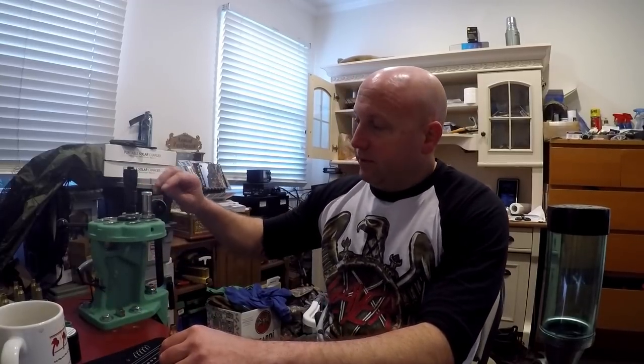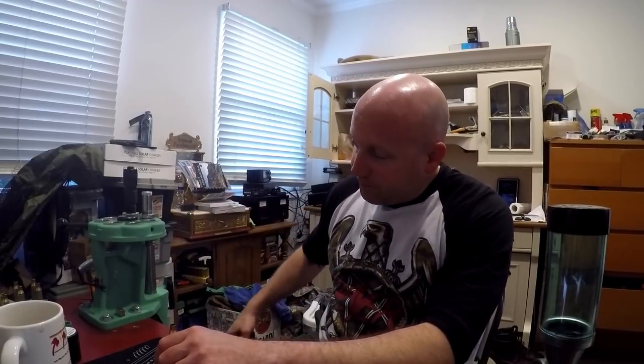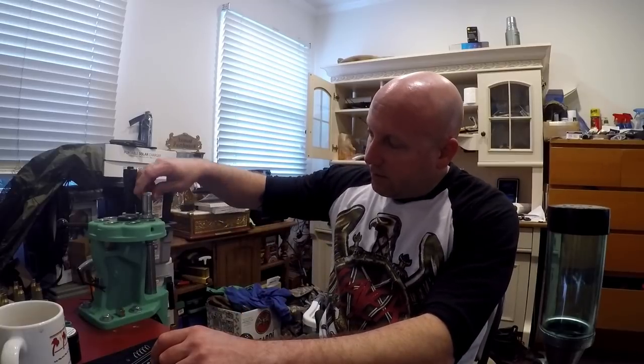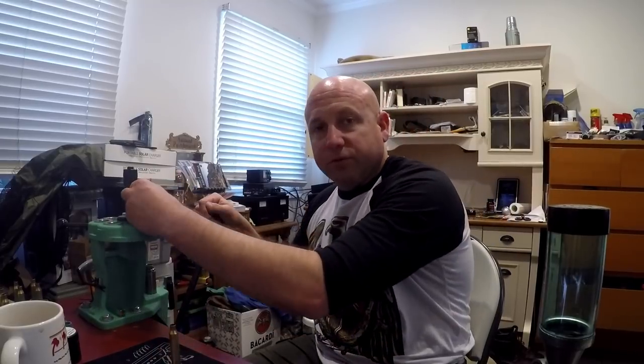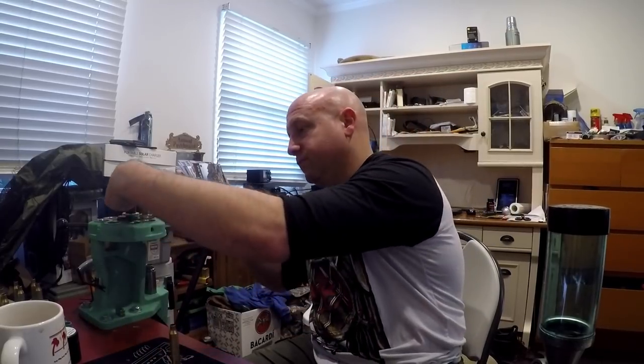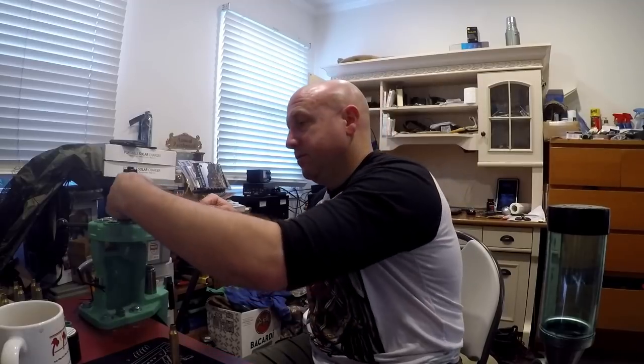Okay, so what I do to set up the Collet neck sizer is I put the ram up and I screw this in all the way until it touches the ram, and then I lower the ram and do one more full turn. So with your hand, you're about two half turns. Turn it, turn it, and you go up. Now you cannot push the ram down all the way. It will not fully extend up. And this is what you want. You don't want it to do that.